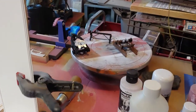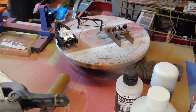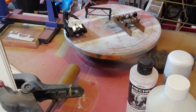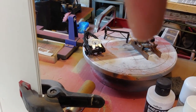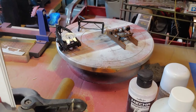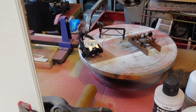Behind me, that's the running gear for the other trailer. The black and silver piece is called the bogey — that one has a set of wheels on it and you can roll it around. Notice it has the hitch part where the kingpin goes in, so you could either hook the truck directly to the trailer or hook this bogey up to the trailer in front of it and tow the two in tandem. Now the one back here — notice how it's brown while the other one's black. The reason: this one is going to be rusted up because it goes inside the trailer that's been sitting for a while, whereas the bogey gets shuffled around so it'll have some rust but won't be in as bad a shape. That's why they're two different colors.